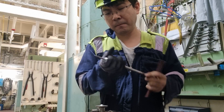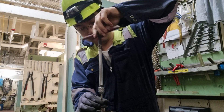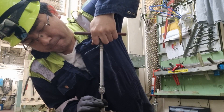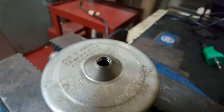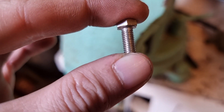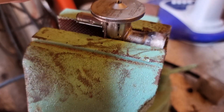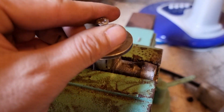Just as with drilling, when making the thread we need to be careful not to pinch the diaphragm. After threading, we will use an M4 bolt around 20mm long, which is enough to push the diaphragm inside. I am using a stainless bolt since our expansion valve is also made of stainless steel.